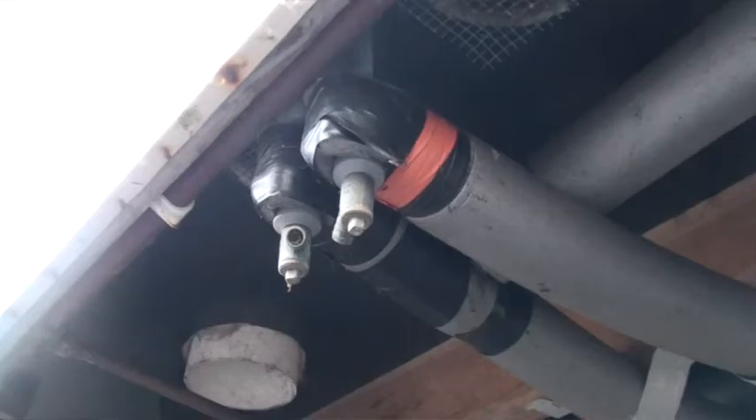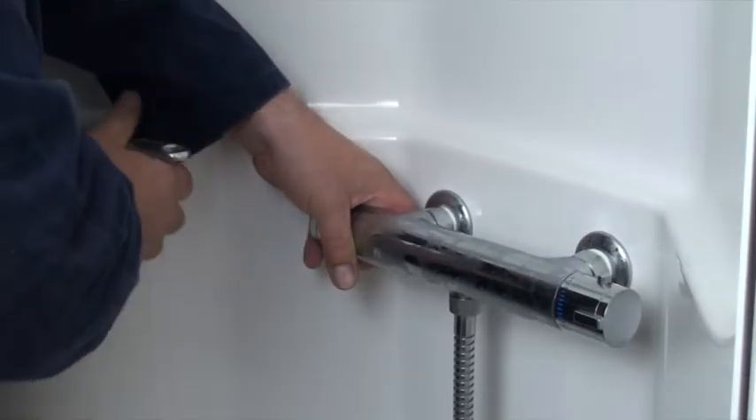So let's move off to the bathroom. Now that we're in the shower, this is where Flow really proves its worth. Because by law, there are non-return valves fitted in the shower. What this means is that water can come out in the direction it was intended, but it can't be pushed back in reverse. Now the old antiquated method of pushing water back down through the system and out of the drain cocks underneath can't be used here. So an engineer will probably remove the shower mixer block and leave it on the floor of the shower until spring, which means the water system and more than likely the property will be rendered useless for half of the year.